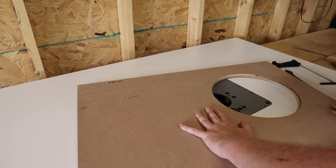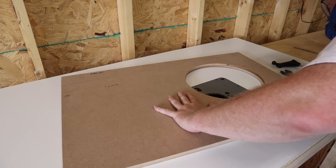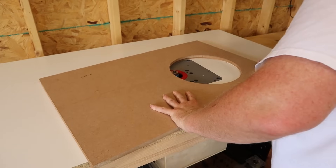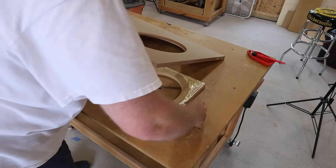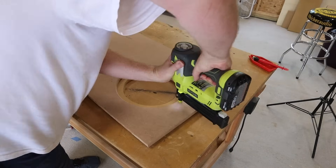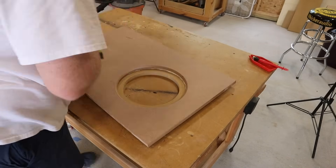Now what I'm going to do is cut an oversized hole in the baffle and then use my router table to make a round over on the outside edge of the baffle and a rabbet on the inside edge of the baffle. My goal here is to cut a recess so the subwoofer can be sunk into the enclosure. For the speaker cutout, I'm going to make that on a piece of scrap and then attach that piece of scrap to the back side of the baffle.